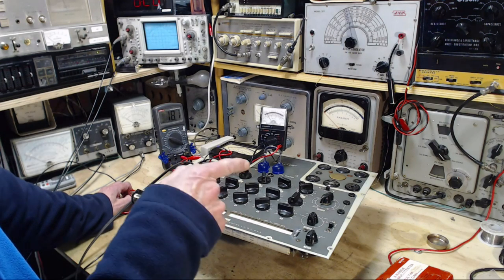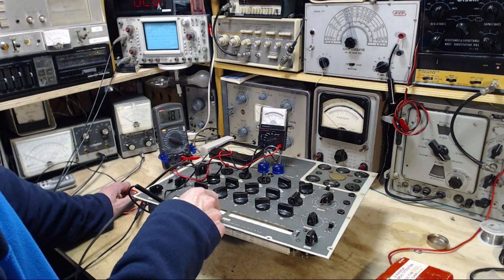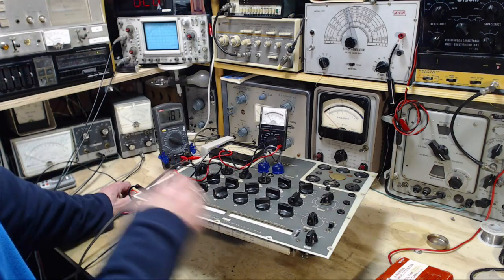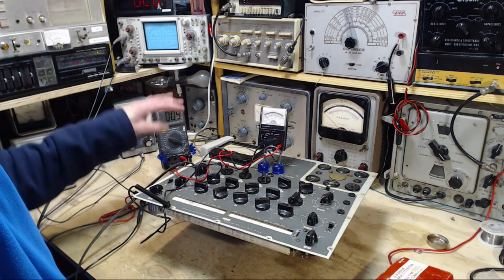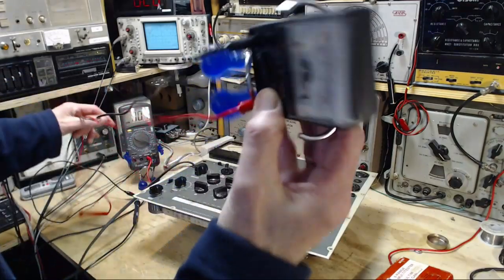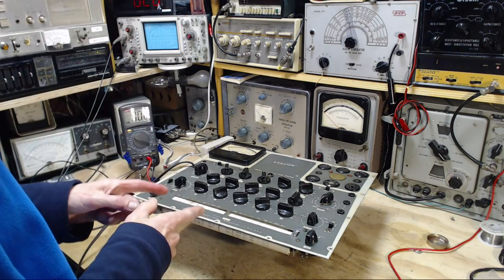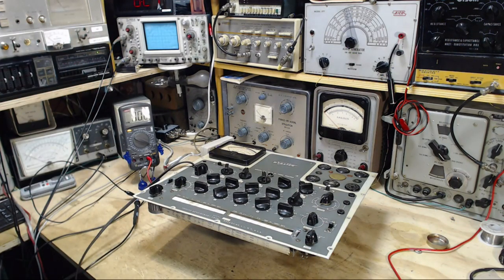There's a high impedance connection from the line voltage somehow through here to the frame, and I can dissipate it, or consume it, I'm not sure what the right word is, by simply putting a ground on there. It'll disappear. Same thing I've been doing to all my pieces of equipment. No worry that there's a solid short or connection between the power line and this frame. Oh my God, they would be crazy to do that on purpose, but you know, things can happen by accident. Somebody could have innocently rewired this at some point, thinking they're doing something good. I'm capable of making those kinds of mistakes. So the name of the game here is three-prong plug. Safety problem resolved permanently for this guy. Now I gotta go find a wire.